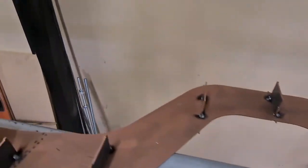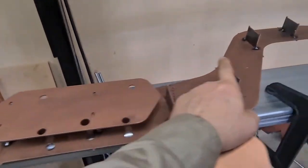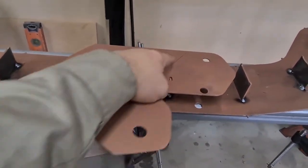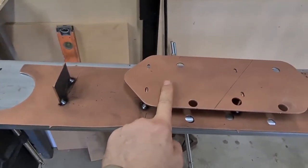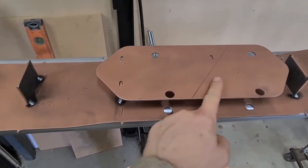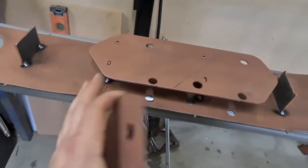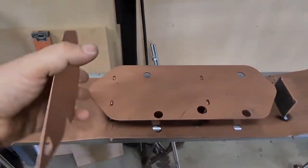Now the fish plate sits on top of there, and then the outer sits on top of here and goes up to this line here. That's where the chassis is cut, and so this slides inside the rail, and the outer skin or rail butts up to the chassis. And ties it all in together, and with these spacer plates here, it keeps the fish plate hard up against the outside of the rail, and all weld in there.